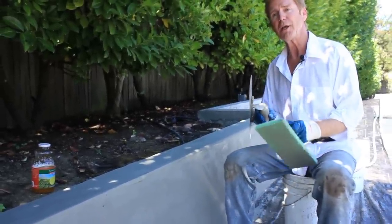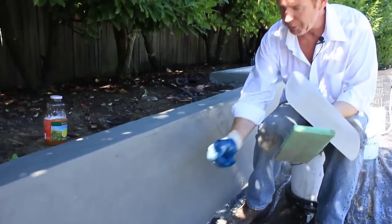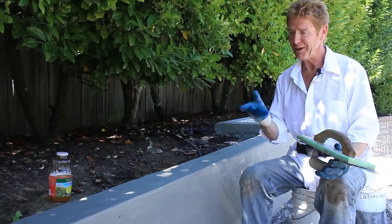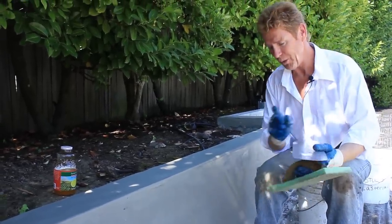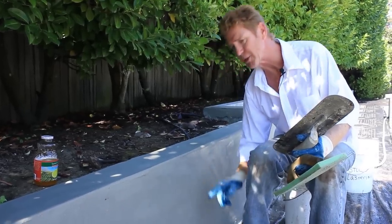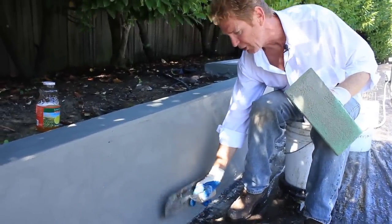When you're doing this system and they give you sand, you've got to make certain that sand is very, very clean. If it has heavy grit, you'll spend hours picking little grits out — it's got to be fine. That's the benefit of getting the color coats pre-bagged. We found some grit in this and we're having a heck of a time. Also: clean tools, clean bucket — take the water hose, clean off the tops and bottom, hose it real well because you don't want one piece of dirt.